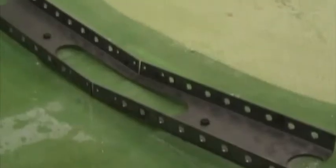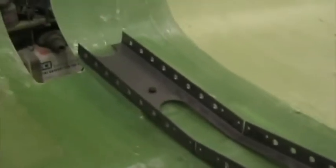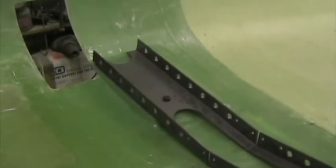The undercarriage legs are now in place. This being a nose wheel, the rounded edge of the undercarriage leg is aft and the cut edge is forward. On the tail dragger it will be the other way around. There's the 10mm bolt, or a temporary one, in the hole. And there's the undercarriage backing in position.